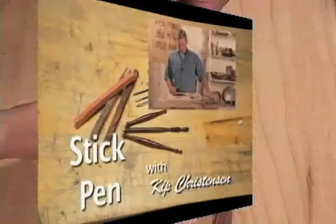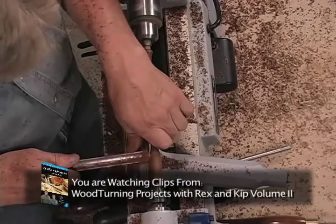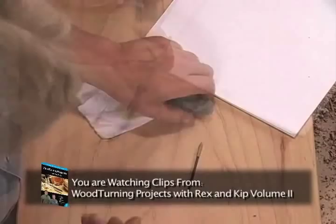Cut it to the proper length. In order to drill this hole the full depth, you'll have to back the wood out of the drill bit three or four times. I'm going to use my left hand to support the wood so that I don't get any vibration. We'll take a closer look at the surface now. Go to the tip end and sand it lightly with 400 to 600 grit — the hole that we've drilled should go in nice and snug. And there's our finished pen.